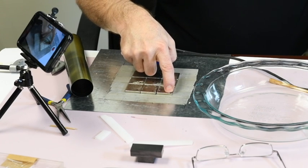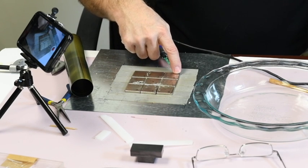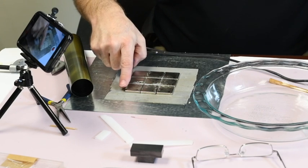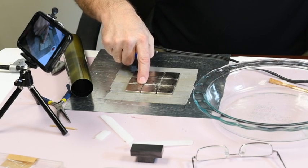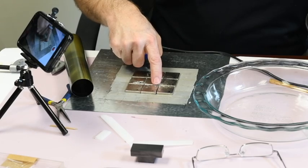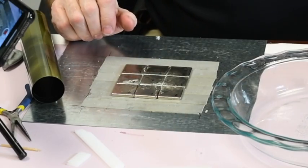The corners read 2680, 2880, 2900, and 2740, with one at 2880 again. The edges read about 1800. All of these are measuring south pole up. If you get right into the crack where the magnets meet, it flips to north pole — which is expected, as some flux leaks between the cracks. The magnetism loops back through because of the air gap there.